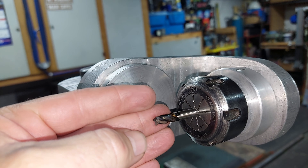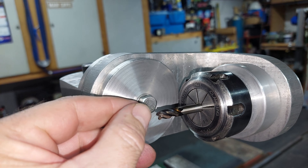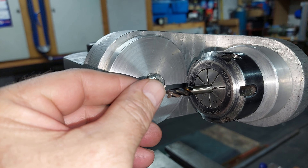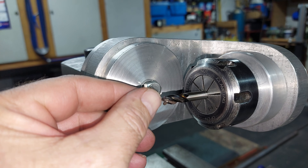I've zeroed my DRO so that when I cut it in and I won't be able to see what I'm doing, I use the DRO as a reference — every time it goes to zero, I know to stop.